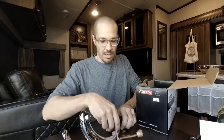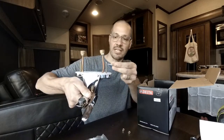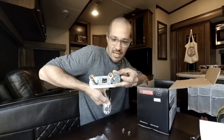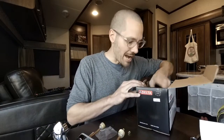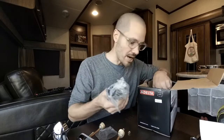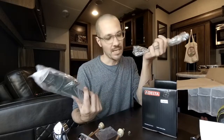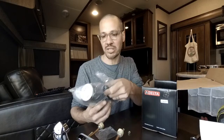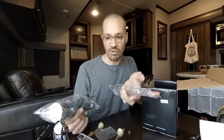The other things in the box are your big flat washers — this goes on the countertop and underneath like that, and then the nut goes on there and that's what holds it in place. The box also includes a tail piece with the plunger and drain assembly, but most RVs I've seen do not have these sorts of plungers. You can just leave the tail piece, drain, and strainer that are already there. You don't need any of that, which really dramatically simplifies the project.